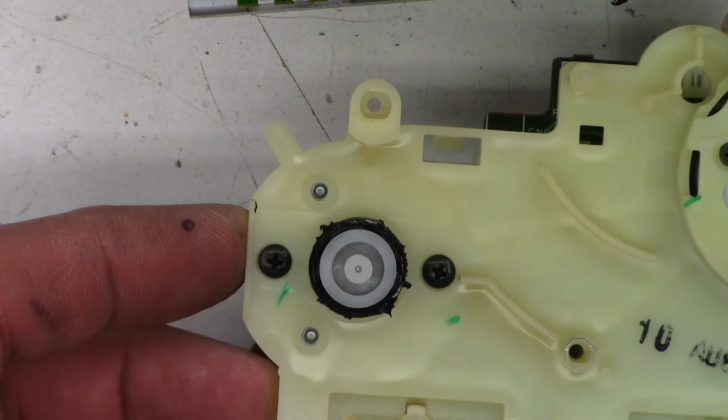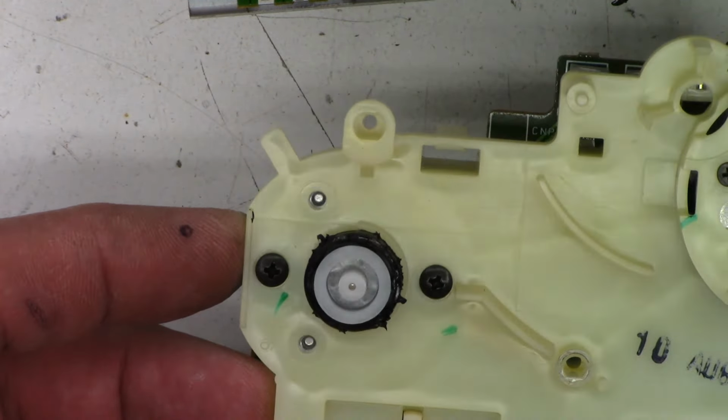Yeah, okay. Well, I may just actually try to pop that pulley off of the motor shaft. It's just pressed on in place. I just got to try to remember the spacing, but I don't think it's that awfully critical. Plus, I definitely want to give it a droplet of oil on the load side of the motor bushing right there to make sure things are going to be good. So let's go ahead and pop everything out. We'll mix up a bunch of acetone, which I happen to have right here. You've seen it before and you will see it again. My favorite solution, the magical solution, acetone.